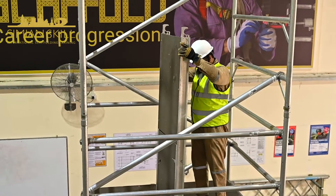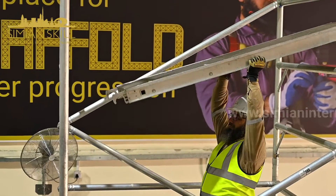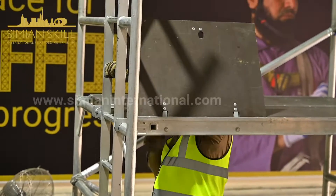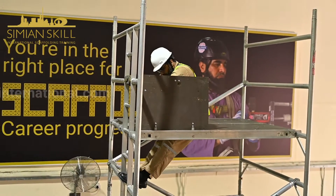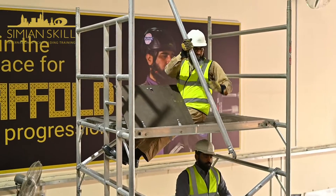The hatch is located and the platform fixed on the eighth rung, ensuring that the locking devices are properly secured. Using the 3T method, four horizontal guardrail braces are installed on the ninth and tenth rungs on both sides of the tower.